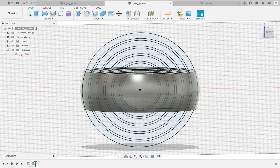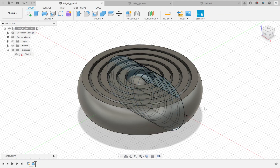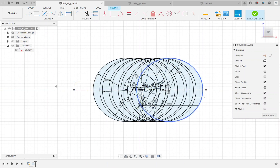So what I did was design it in a different way. Instead of using a series of concentric circles, I made a series of 20 millimeter circles placed at different distances along these lines and then revolved those profiles. That way all of the outer curves had the same slope because they were all part of the same 20 millimeter circle, which increased the mobility of each ring and prevented them from sliding out of one another.